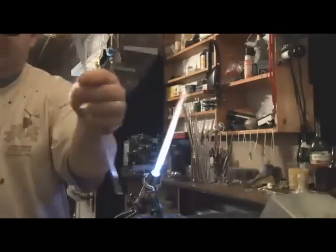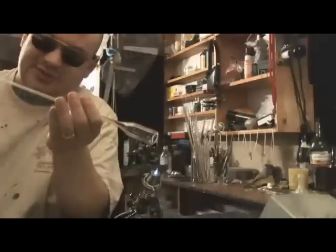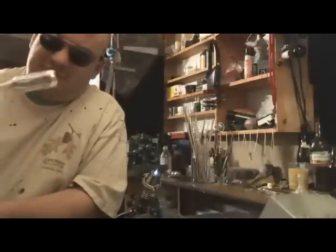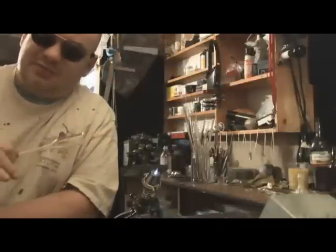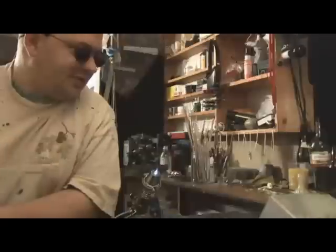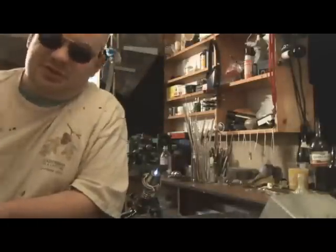Maybe somebody has a better way of doing it without a cold saw. But unless you intend to spend the money necessary to buy a cold saw — which is a specialized piece of equipment for cutting the glass while it's still cold, and it's got to cool it, and make sure that the little powder glass doesn't fly off and end up in your lens — this is the way to do it. You just get a little hole started and you open that sucker right back up. I use the L in my graphite marving pad on top of the torch to control the outside radius and inside surface. I just use a round piece of graphite, put it in there and push towards one of the walls — and voila. That is how I open up a clean cut 25 millimeter and larger tubing.